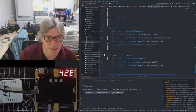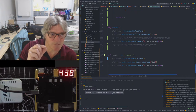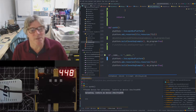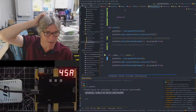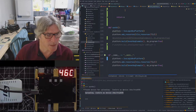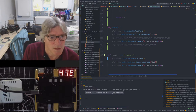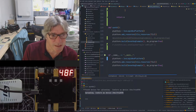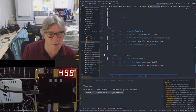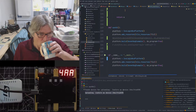The TQFPs are a nightmare. I've been reducing the aperture for the paste layer, so there's less and less paste underneath the TQFP. And when I'm ordering it now, JLCPCB freak out. They never go straight to build because they say, your paste layer is much smaller than your pads. Are you sure you mean to do that? Or would you like us to use your pad area instead? So I always have to respond to them and say, no, I've purposely reduced it for this particular reason. But sometimes I'm not sure that they actually follow that, which is really annoying.